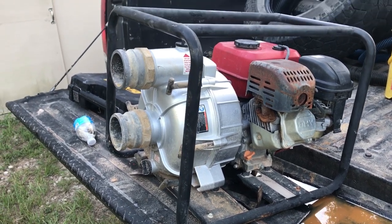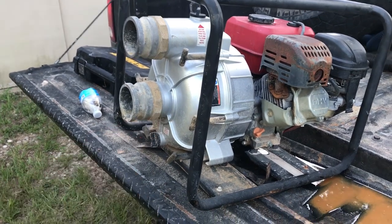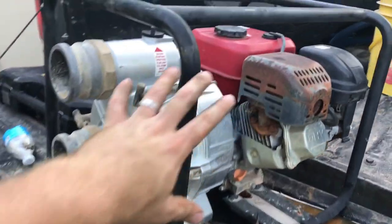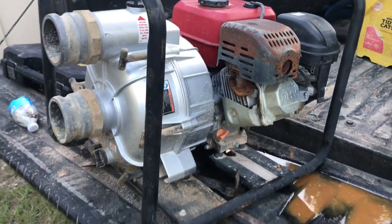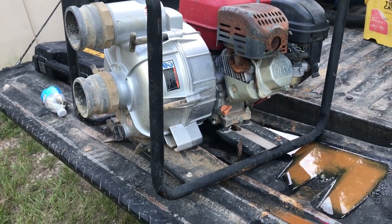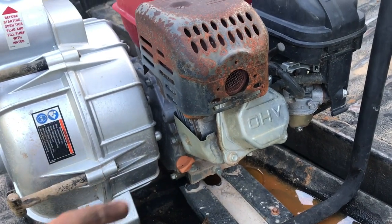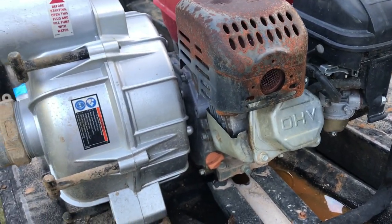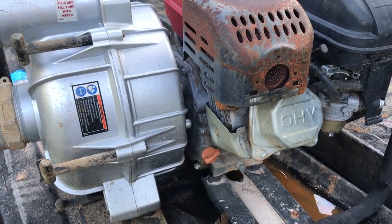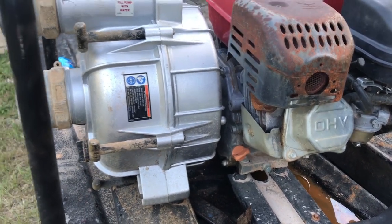Your engine doesn't lock up that fast, so I thought maybe one of the bolts inside the housing vibrated loose and got the impeller locked up. I threw it up on the tailgate, tore all this down, got the impeller off — nope, all the bolts are good and tight, still locked up. So I took the back of the housing off — those four bolts — pulled that off and was able to get a pipe wrench on the drive shaft.